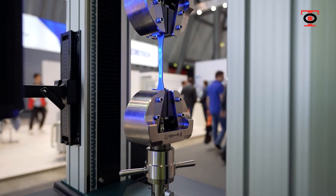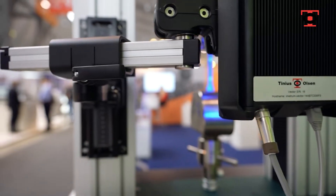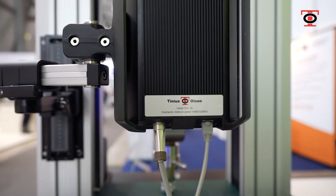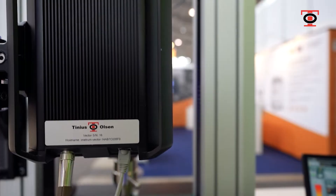We recommend using a pen for marking. The minimum gauge length of the unit is 25 millimeters, and you can go up to about 180 millimeters in gauge length. The field of view of the system is 200 millimeters, and it is therefore a very good unit to replace the most common clip-on extensometers within the ranges of 25, 50, and 80 millimeters that are used in most laboratories.